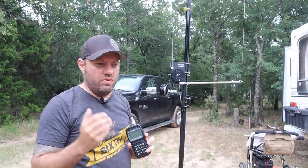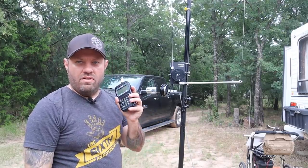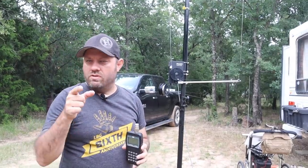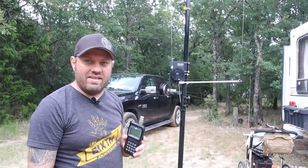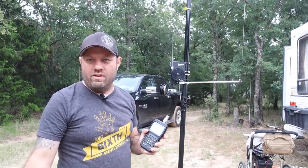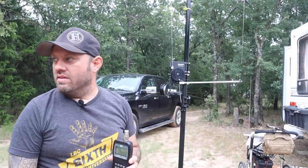It makes it incredibly easy - put an analyzer on it, watch where it goes, set the color-coded piece to the band you're tuning, then tune with the counterpoise crank, half a turn to one and a half turns and it's done. I used it with my Flex Radio to do FT8 on all four bands and it worked very well. So thank you to StepIR and to Jeff - this is a great antenna. Now that I know how to set it up, I could do a Parks on the Air activation and probably be set up and running in 10 or 15 minutes. This is the CrankIR from StepIR.